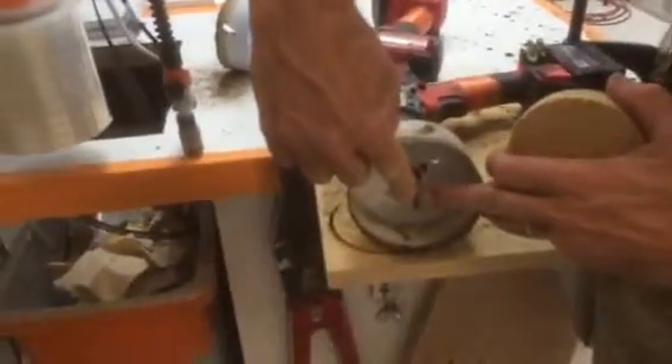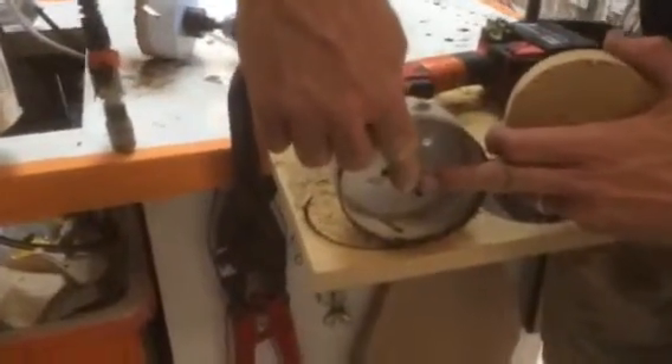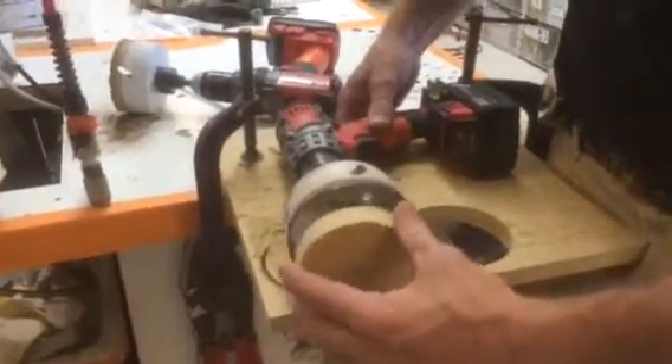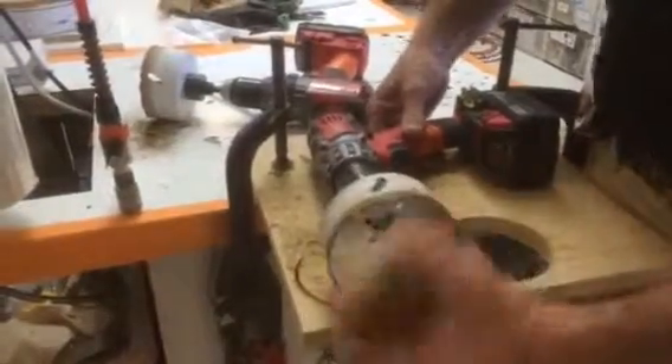We can solve that by having this drill bit shouldered in. Your pilot size could be a quarter inch, but imagine a smaller diameter shank there. I think the binding is occurring on the drill bit as much as anything else in there. But it's still totally easy to get out. I'm going to show you another demo on a piece of dimensional lumber.